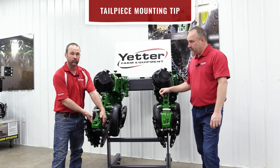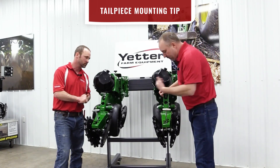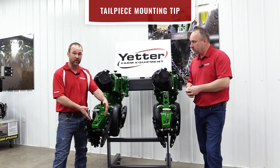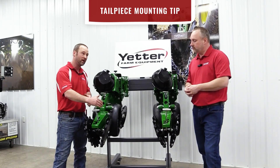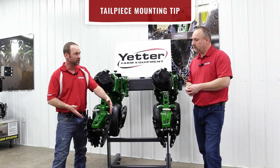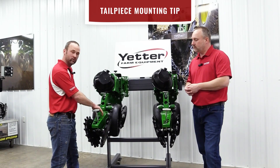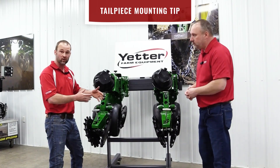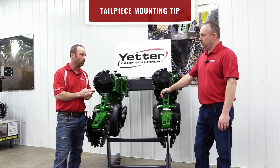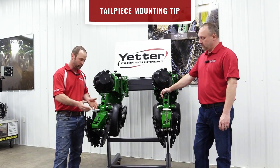Most tail pieces come with two holes per side, and the most common is probably to use the rear hole. From our testing and experience, we like the wheels side by side — I'm not stringent on whether it's the front hole or the back hole, but I want them side by side. That action of marrying the soil together means both sides push together at the same time. One advantage of the front hole is that if you've got some contours, it tracks a little closer to the row unit and will track better on contours. The disadvantage is that in wetter conditions — maybe a swale in the field that's a little too wet — your row unit is more prone to plugging with them tucked up closer to the row unit.